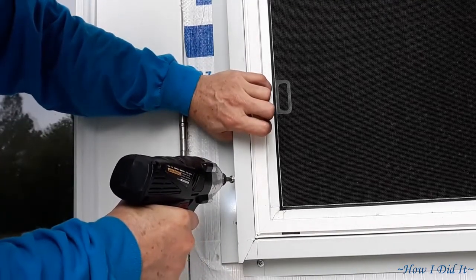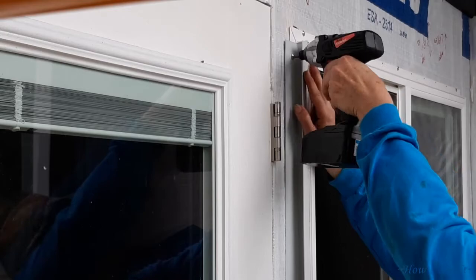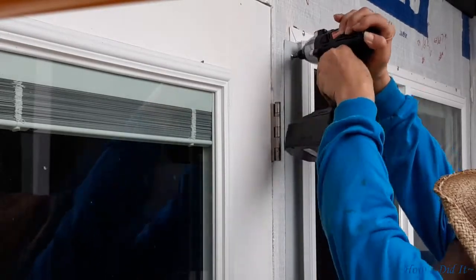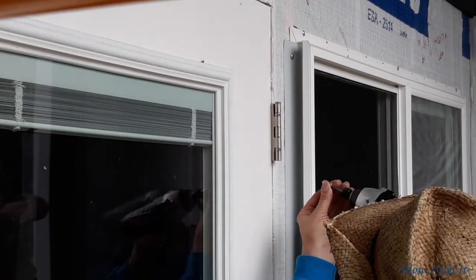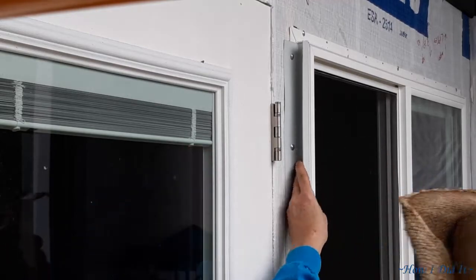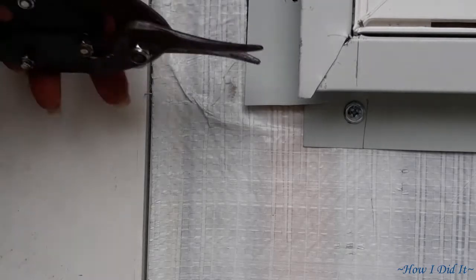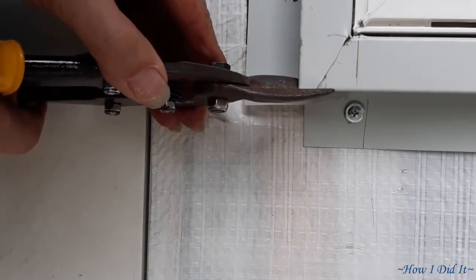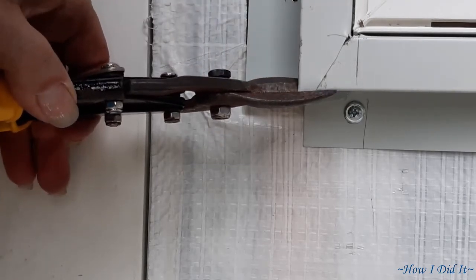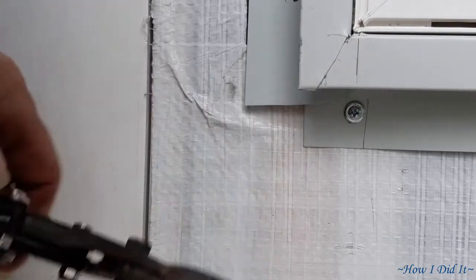It really is cool. I mean, I studied and studied and studied, thought I was prepared. This took me quite a learning curve and it took me quite a bit longer than I thought it was going to take. It is pretty amazing — you take your tin snips, get it up on there, do your cut, and it just cinches that corner down together and gives it a beautiful finished look.